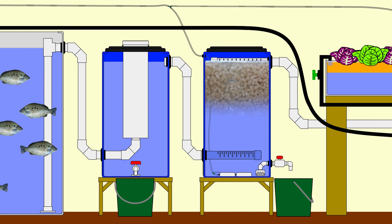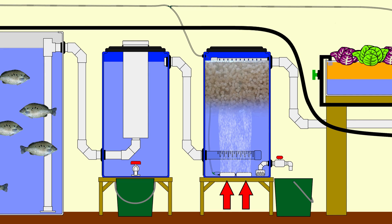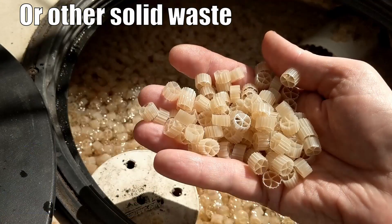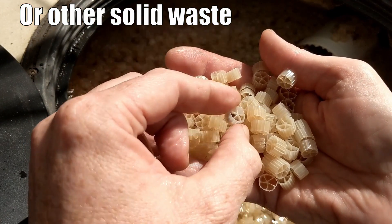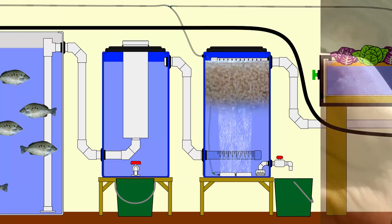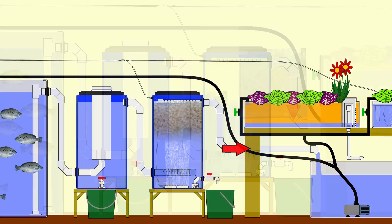As for how these biofilters work: water comes in through the inlet at the base. I'd use a 200 litre filter — the same as the radial flow filter — giving a retention time of around six minutes at a 2000 litre per hour flow rate, giving the bacteria on the bio media plenty of time to process ammonia. There's also an air source in the filter because bacteria need oxygen to convert ammonia to nitrite and then nitrate. The air also moves the media around, knocking off dead bacteria and keeping it running efficiently. Once the water has moved through the media and out the drain pipe, it flows down to the sump tank to start its journey again.